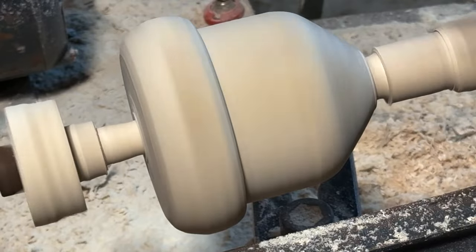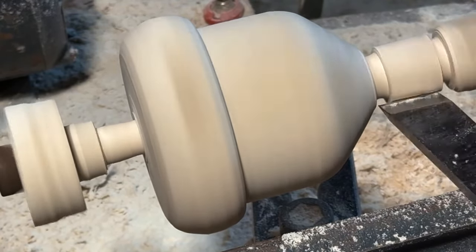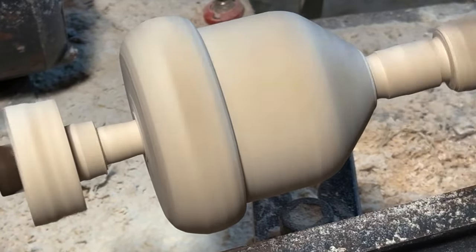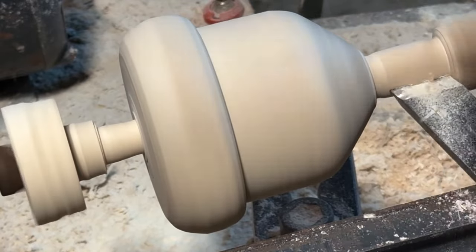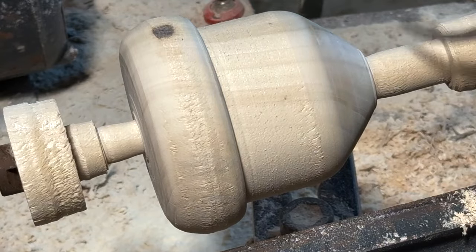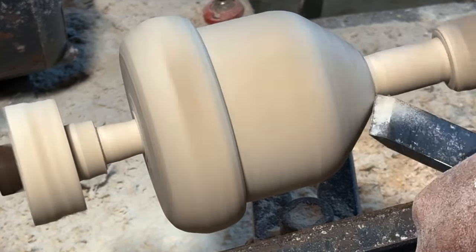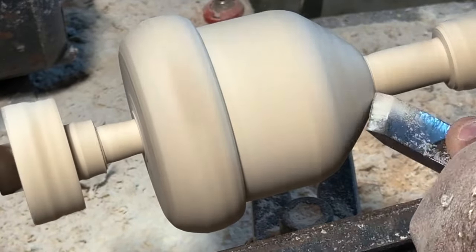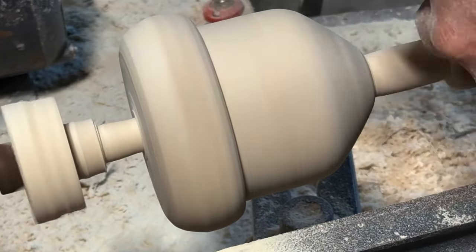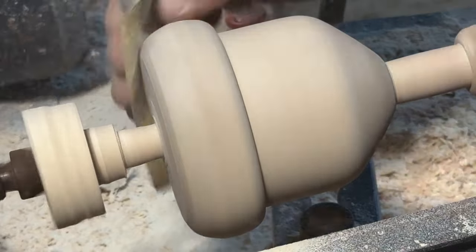This is the area we're going to take down to three-quarter inch to make a dowel — that way when we drill into our post top at the spiral stairs, this will fit in there snugly and then we'll glue it in place. We'll take a little sandpaper starting with 80 grit, work my way to 120 and then 220. Got it all smoothed out.